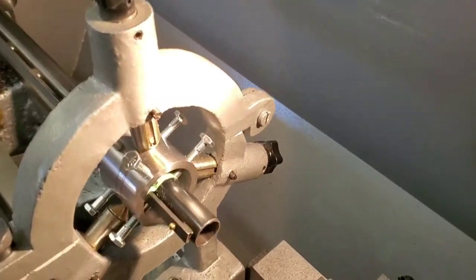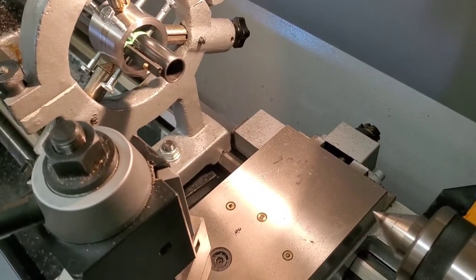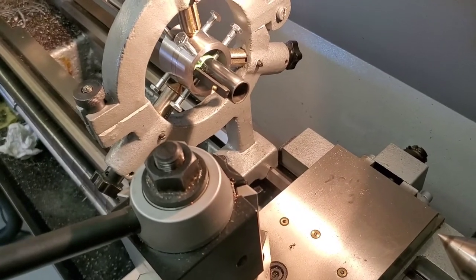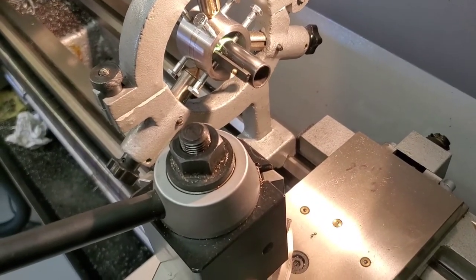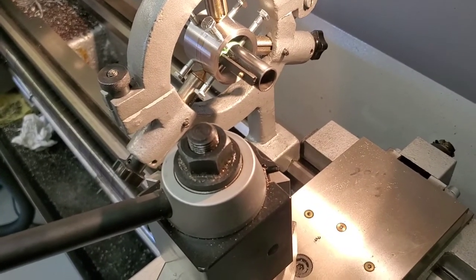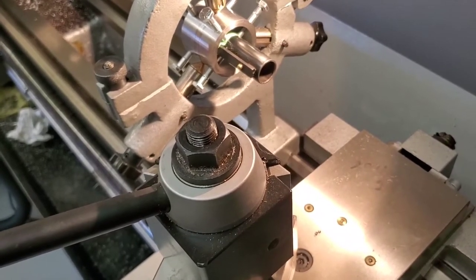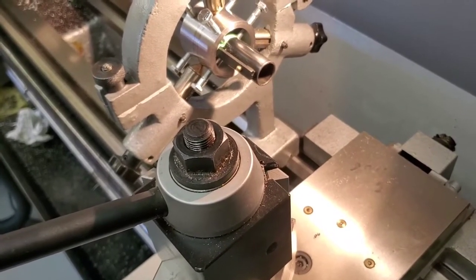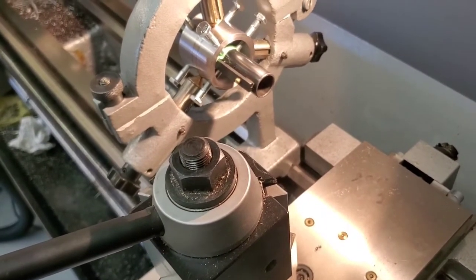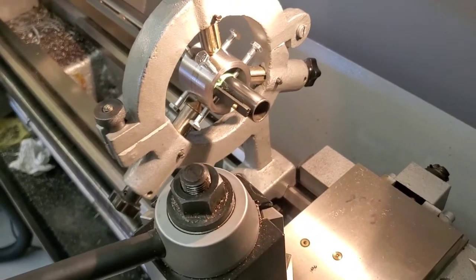So now that that's all set up, what I got to do now is figure out some math, where some of the smart people would say maths with an S. It's weird. Anyhow, I got to figure out the inner diameter that I've got to bore that out to. And then I've got to cut a little gutter relief in there for my threading tool to fall into. So I've got to do some math. And then once I get everything all set up with my boring bar and everything, then I'll bring you back again. So bring you back here in a second.